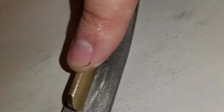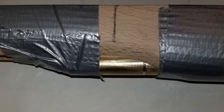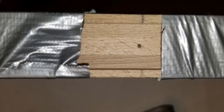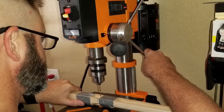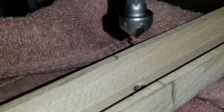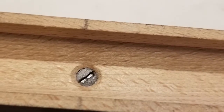With the minor touch-ups done I moved on to trying to seat the thimble to see what needed to be sized. I filed the rear thimble to fit the factory inlet and then touched it up with some sandpaper. After I taped it to the stock and marked the stock to drill the hole. After drilling the hole I countersunk the hole and ran the screw through with a screwdriver to tap the holes.